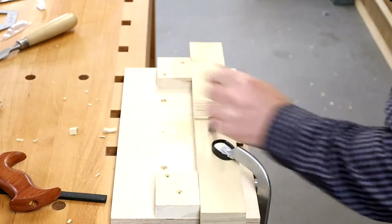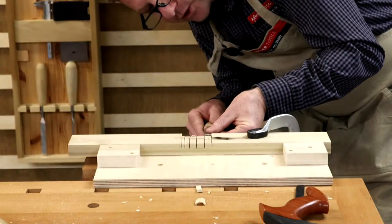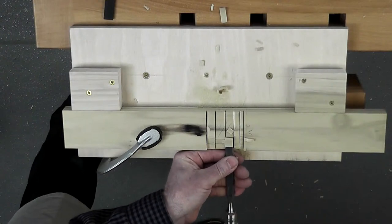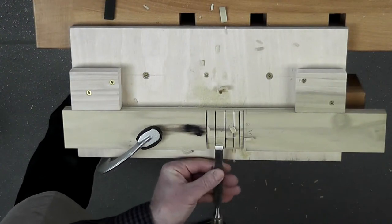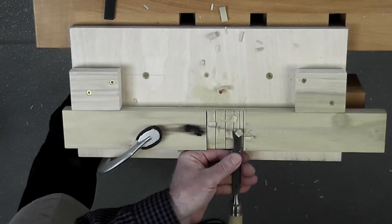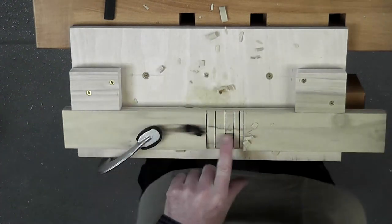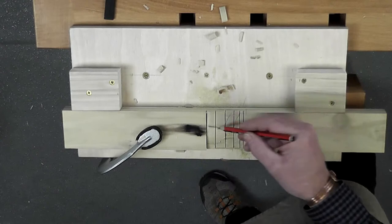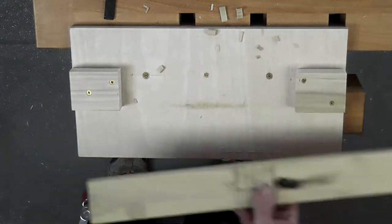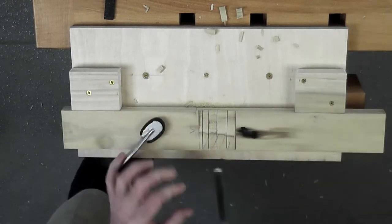So knocking the tops off, really. I'm aiming to come upwards. I'm not coming all the way down to where the scribe line is, working across that length. Take a bit out the middle. The other thing you'll probably notice, on camera four, I'm not coming all the way across. So we haven't touched the fibres on the back yet, because you can't see the break line. You also run the risk you'll splinter them out. So we turn it round again. We do the same.